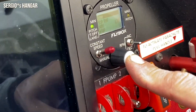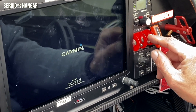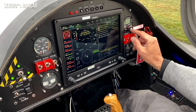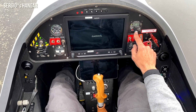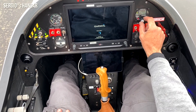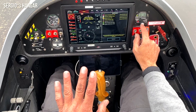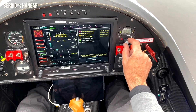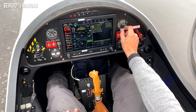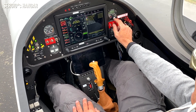I press the button and go to Setup, then press again to go to the second option. In the password field, we set the password to 1220. We go to the latest option — RPM ratio. The value 030 is for a 4-cylinder engine, so we change it to 060. Now we go done, and we're back.